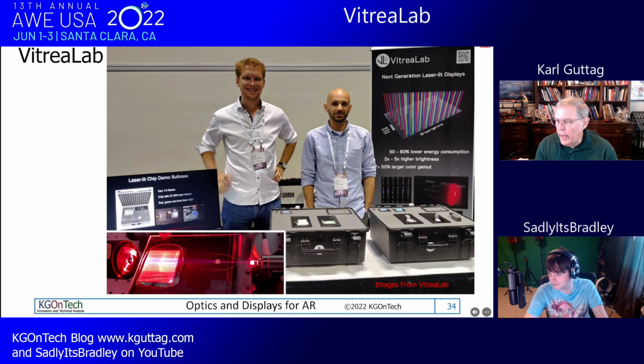They've got a thing where they basically have this structure that takes that laser light and has a waveguide. And there's little teeny tiny mirrors, effectively. They're going to shoot this light up. So they're literally taking a single laser beam and keeping it as a laser. They're not just a diffuser. They're going to take the laser beam, and you kind of see it starting here. They're going to split that laser beam and make it into an array of little tiny lasers. Now they can do this for an LCD where they end up with a laser per pixel. So imagine each pixel in an LCD is individually illuminated by a laser. So now you've got super highly collimated light. You've got basically laser light.